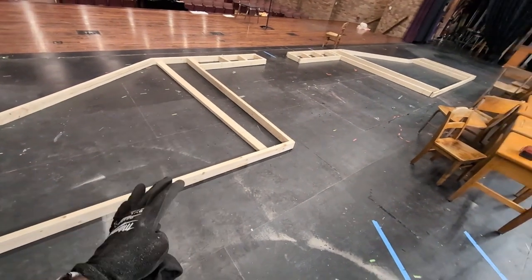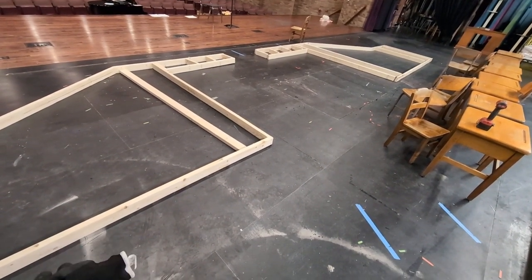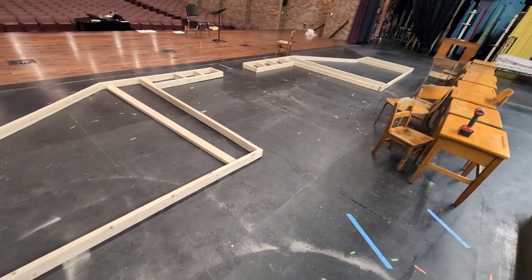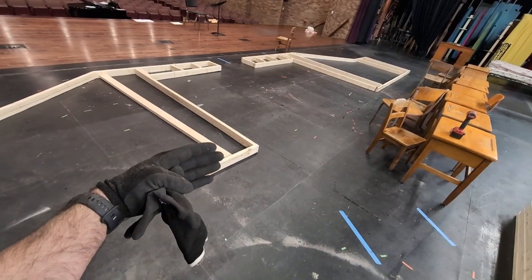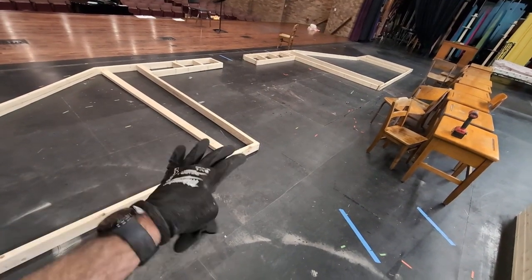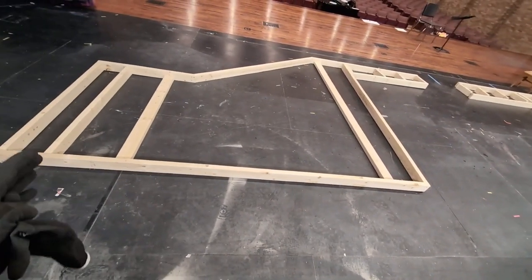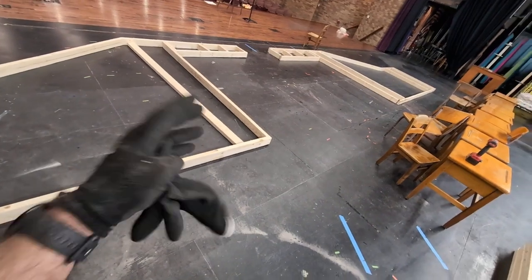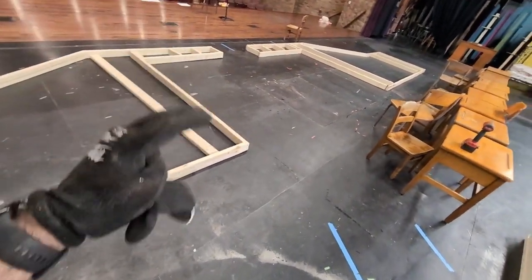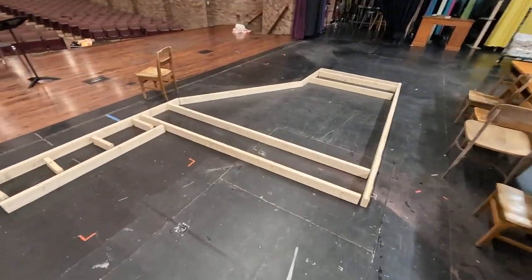So first we frame it, then we get the frame wheels on, and then we get the frame up and rolling, and then we put some half inch plywood scraps on the floor and start the Luon sheets standing on the plywood on the floor to preserve that gap. And then we rack the construction around until the nice factory square edges of the plywood are nice and flush with the verticals on this framing. And we put some pieces on and we continue to chase down that plumb, level and square quality in the right order. Okay, so that's what you'll see me do.